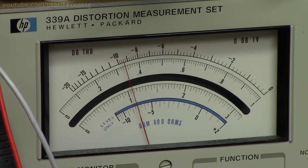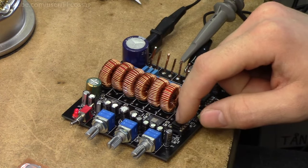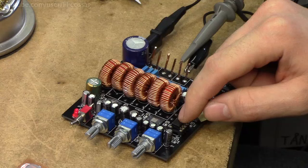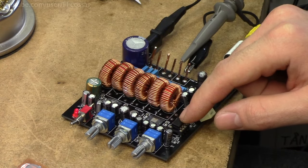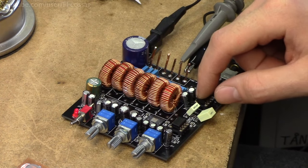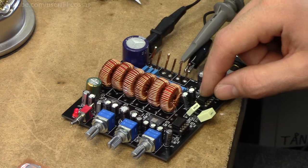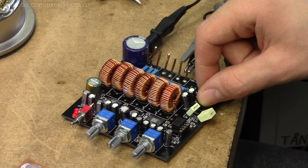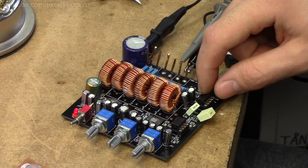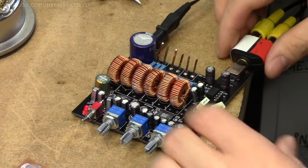They should actually be mono-mixing it right off the get-go, and just applying more stages of filtering. Or they might be mono-mixing it somewhere along the path. I'm pretty sure this op-amp, at least, has a stereo signal going into it, and a stereo signal going out of it. Yeah. I haven't bothered reverse engineering this very properly, I must admit. I've mostly just been swapping components randomly to see what happens. But anyway, that at least gives this particular board a reasonable response.